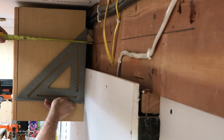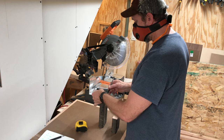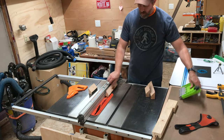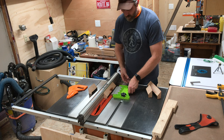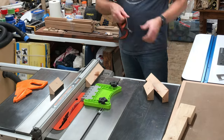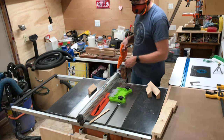It was at this point that I realized I had forgotten to make another rip cut to make the boards the right thickness to take up the space above the drywall. If I didn't do this, the cleats would push the top of the cabinet away from the wall and it would tilt forward. So now I need to take these beveled pieces back to the table saw. It definitely would have been safer to just start over with a new board because 90 degree cuts are easier to control, but I decided to take a chance and trim down these boards that already had a beveled angle on them. The angle increases the chance that either my push stick or the workpiece itself could slip toward the blade and create a kickback situation. In general, you want your off-cut to be on the outside of the blade — that is the side opposite the rip fence.